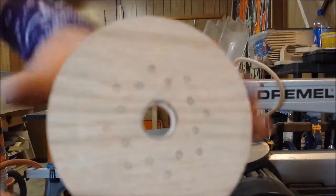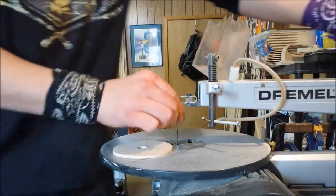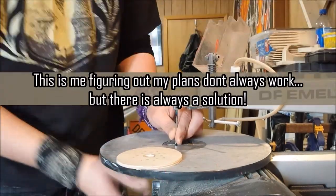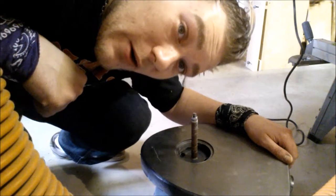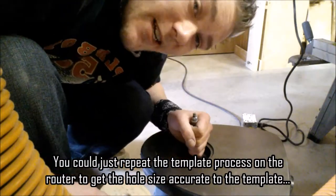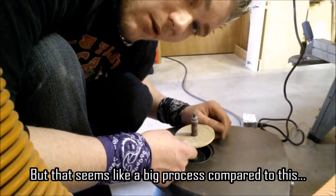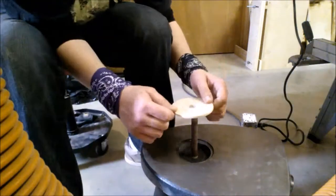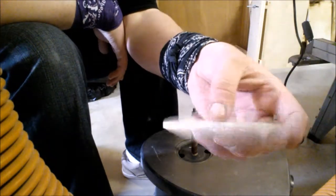I've drilled a 5/8-inch hole here, but it has to be just a tad bigger than that. I'm going back to the scroll saw to undo my blade — but the scroll saw deal didn't work; the hole wasn't big enough. New plan: this hole is the exact size of the spindle, so I'm basically just going to drop it down on the spindle while it's running and run it around a little bit, just to widen the hole so there isn't any binding in the future. And that is the exact hole size that was there before — much easier than doing the scroll saw. I should have thought of that before.